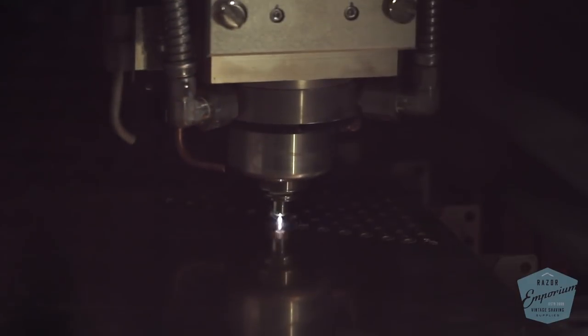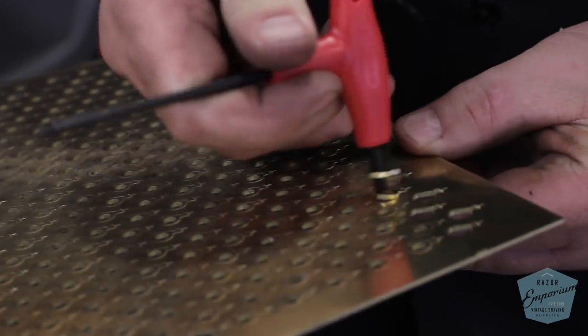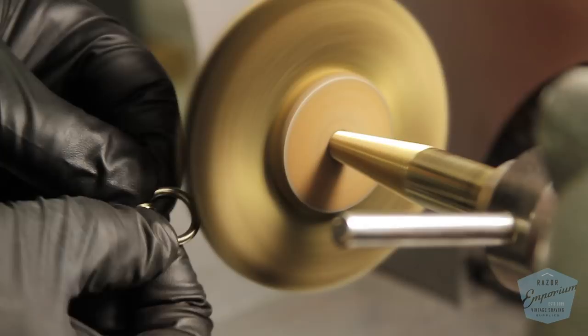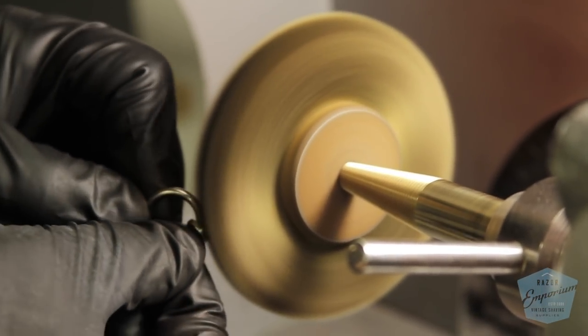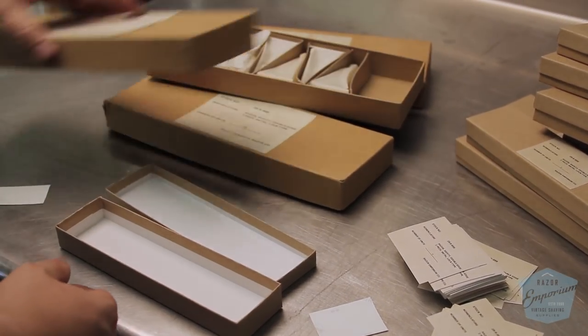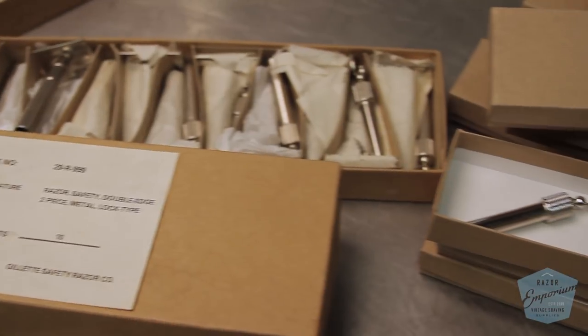The last two pieces were the hardest. We have a brass eyelet that we laser cut using a specialized laser up in northern Arizona that can cut sheet brass. Then we worked with a jewelry studio in Missouri to make the jump ring out of steel — it's number 10 gauge, exactly like the original, with the same outer and inner diameter, so it's a perfect match. Even the packaging was carefully matched: a similar proportional box scaled down for one key instead of ten, with that same craft brown cardboard look. The label replicates the 1960s layout and proportions, and we even gave it an aged look to resemble old paper, so it looks like you're getting a scaled-down replica of the entire original set.